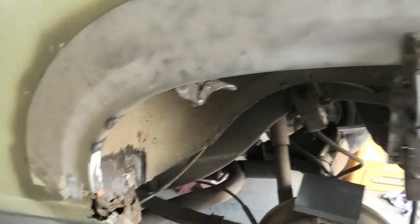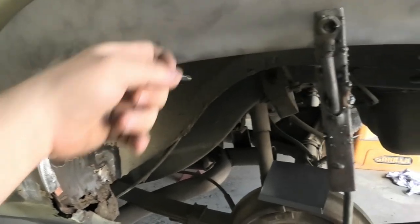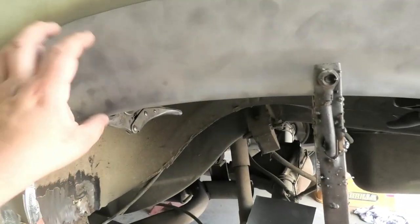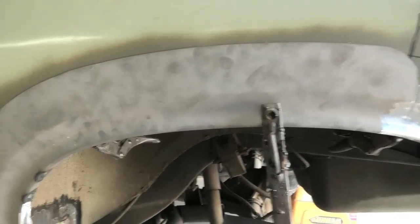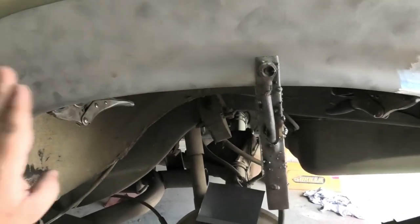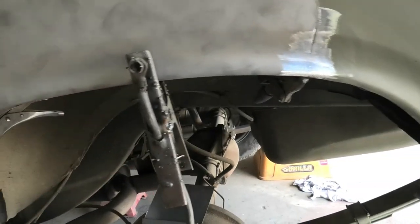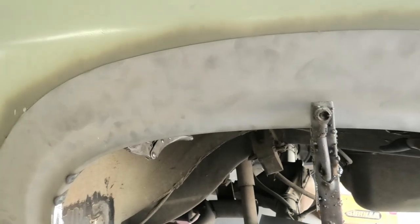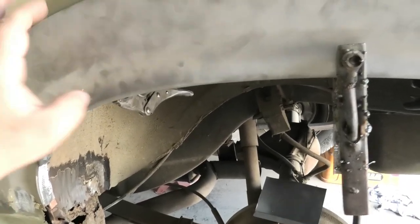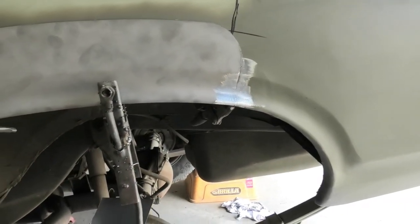I was saying to the chap earlier, prior to these being available, you used to have to use front mudguard ones. For the left rear, you'd use the right front, and the left front for the right rear. You'd flip them around and they'd be the same profile as the rear coupe quarters. So if you used to go through the wrecking yards and see front guards with wheel arches chopped out, you knew that they went for a coupe. And I believe they're also useful for a sedan. So if you need the wheel arch for the back of a sedan, I believe it's left front, right rear. The diagonal opposite is the same shape, or at least it gives you something to work from that's very, very close. So progressing along nicely.